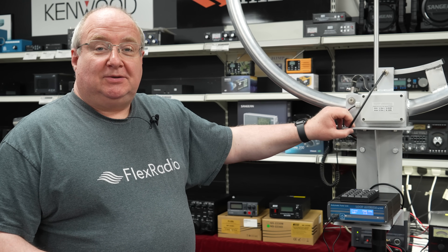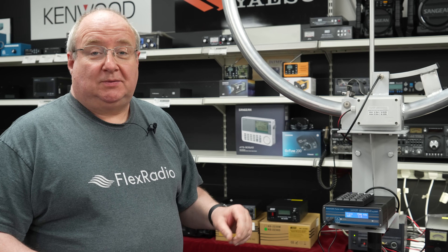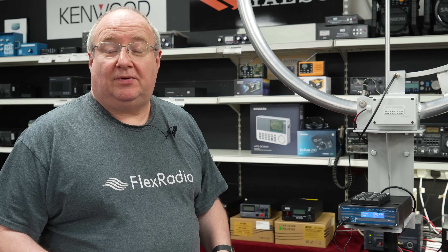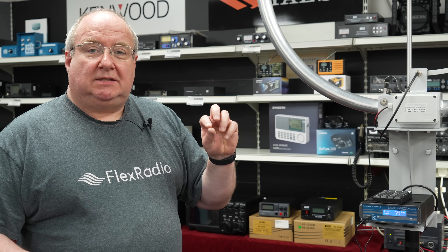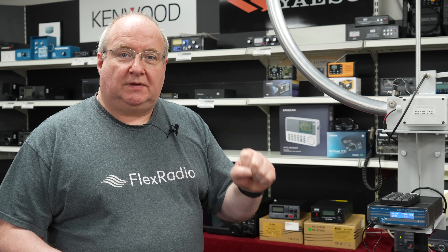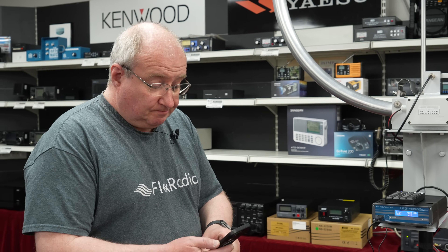Do you need a particular type of coax? No — any coax will do. RG58, RG8 Mini, RG213, a bit of Ultraflex 7 — whatever you've got laying around is absolutely fine for HF. If you're going for long runs along the ground you might want something with good protective casing, like one of the Belden cables, but any coax is fine.